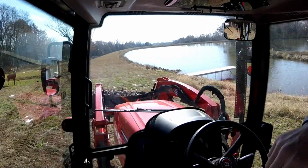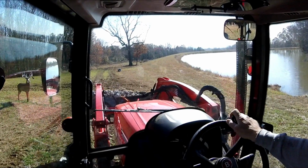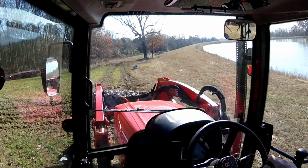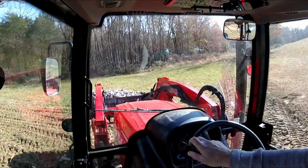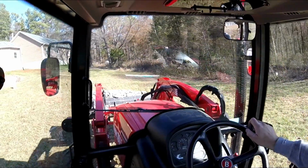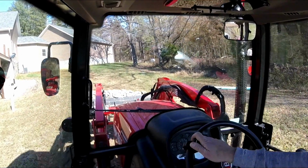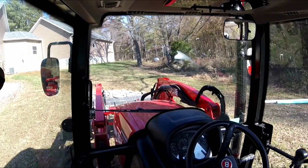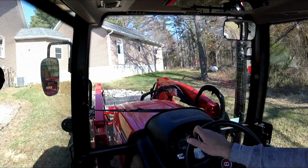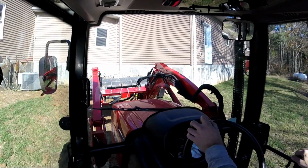Alright, so I'm not going to have a ton of video of this part, but now I'm bringing 3-inch clean gravel for the base. I'm going to put roughly 8 to 12 inches of gravel in the base, just to give water a place to drain under the concrete, so you reduce the chance of it heaving in frost. But with this being next to the house, in the sunlight, it's getting radiant heat from the house. There will never be a frost line here unless the global warming craziness gets worse, but it won't go down past a few inches up here, maybe 6 to 12 inches max during a polar freeze. Otherwise, with gravel on the bottom, the water has a place to go, so it should be just fine.